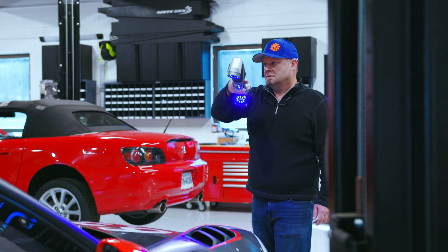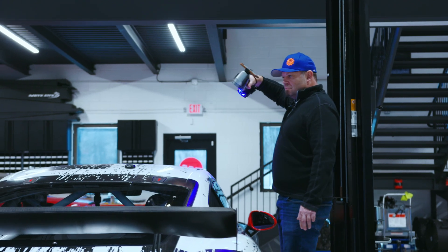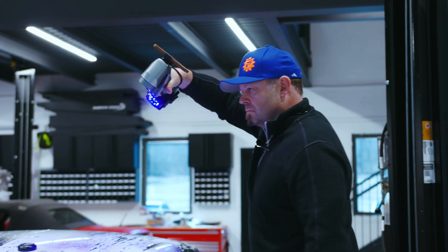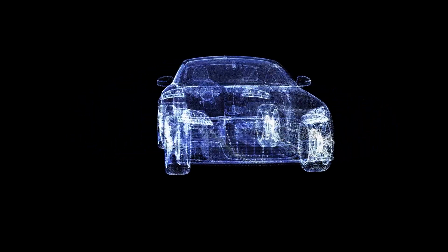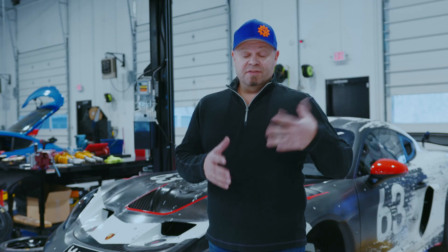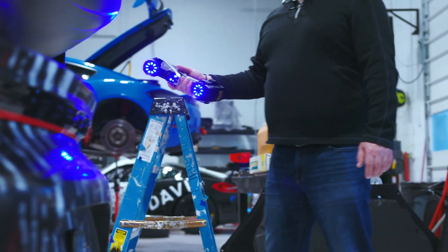The adaptive photogrammetry of the KScan X allows us to have much higher precision over a larger area when scanning a complete vehicle. The wireless capabilities allow us to completely scan an entire vehicle by just walking around, without wires in the way or having to be followed along with a laptop or other computer and power sources. This allows us to complete an entire vehicle in roughly 10 minutes after it's targeted. Even though this was the first time we've used this scanner today, it was very intuitive with the button layout and the software itself — I could probably get right into scanning immediately and train my staff to use it as well.